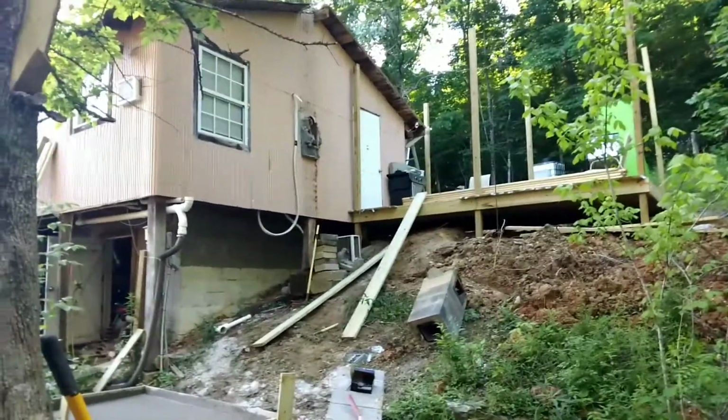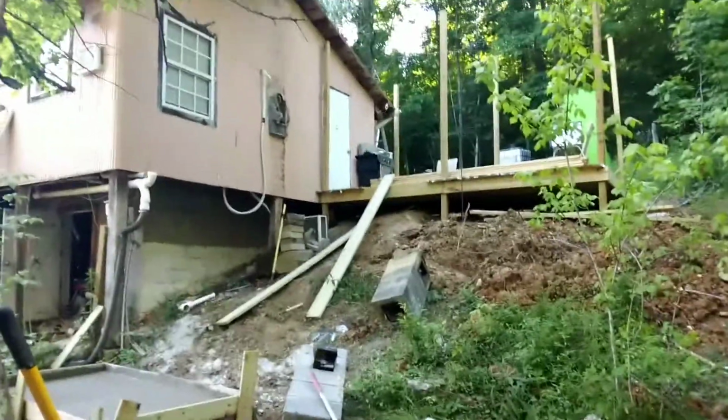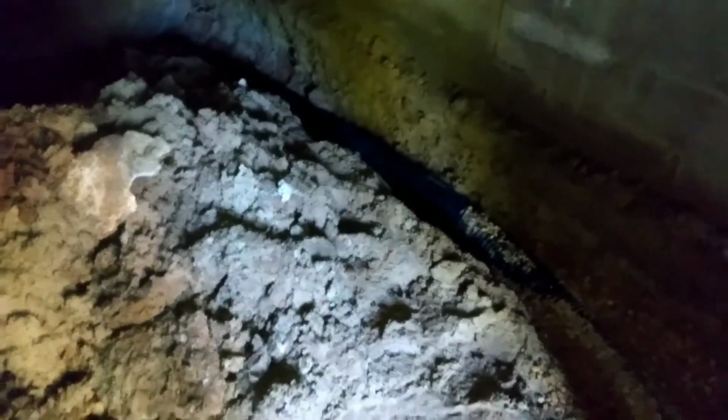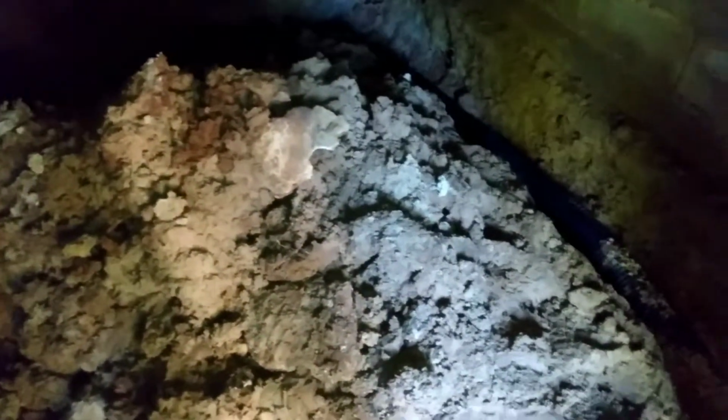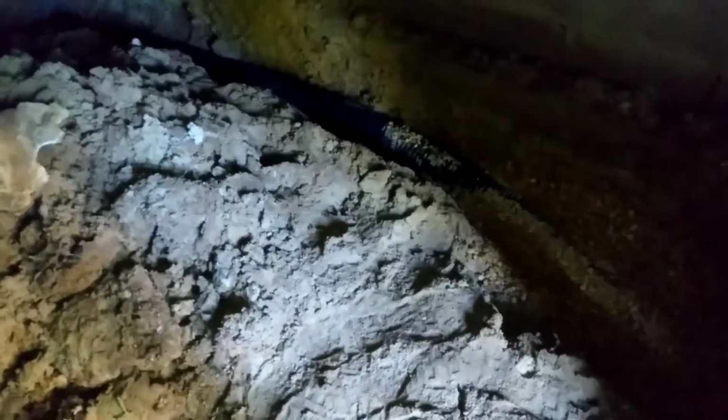Alright, I'm going to look at some drainage that we're working on in the basement, and then I'm going to go up on the deck. This concrete block room here would flood every time it rained real hard. So we've been digging trenches, going to put in some black pipe and hopefully concrete this floor at some point. With these trenches that go all the way around, this is doing a lot to help keep the floor a lot drier, instead of sometimes it would be like a lake in here.